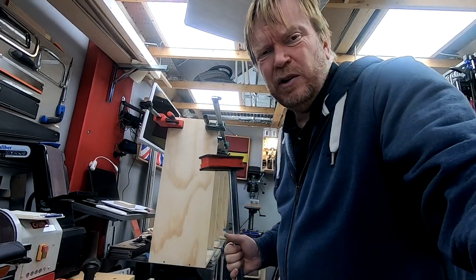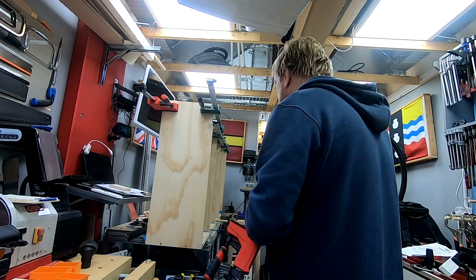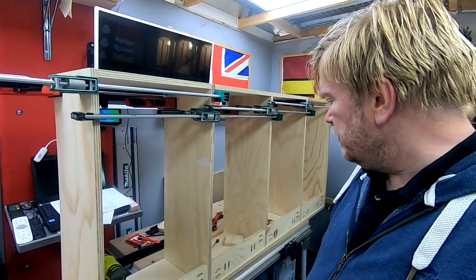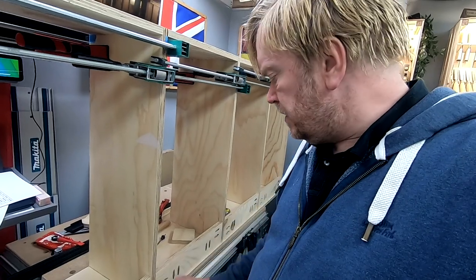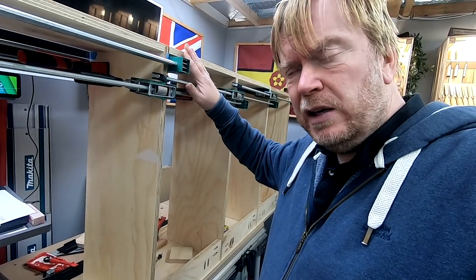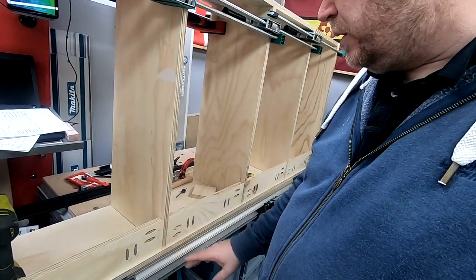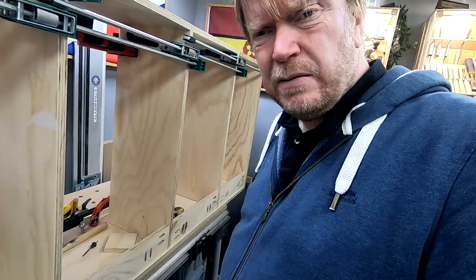This is proving to be one of the longest glue-ups I've ever had to do, and I'm really quite happy with how it's going. The cabinet is clamped up and I've got back brace supports in. This is typically how I do a cabinet — I put the back brace in and then add the skin over the back. I prefer pocket holes: there are eight per board and the joints are staggered. This is my preferred way of doing it.